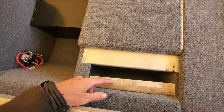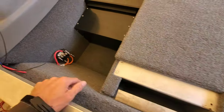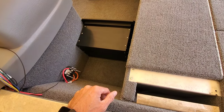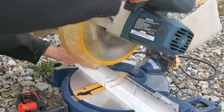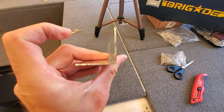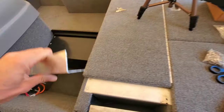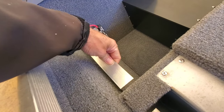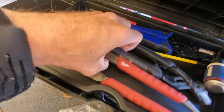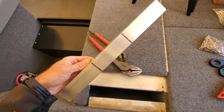These two parts are factory. This halfway supports the lid and then supports the deck part that went here. All I'm going to do now is go ahead and continue some framing around the top perimeter to support the deck. This is just 1/16th inch, inch-and-a-half by inch-and-a-half angled aluminum. I cut these relief joints in it so I could bend it over to mimic the angle that I've got over here. I'm just going to start bending and get it about how I want it and install it.